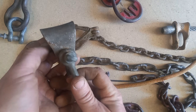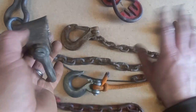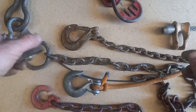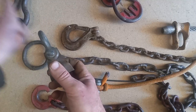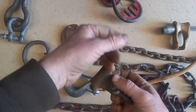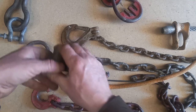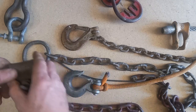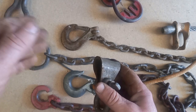Now mainline slides — this is a mainline slide I made. What a mainline slide allows you to do is bunch logs. Bunching is when you've got tree parts scattered everywhere in all directions and you run one cable through the whole mess, hooking a choker around each one. Your mainline fishes through, and at the end there's a termination. When you winch in, it pulls your furthest log, which slides and hits the next, bunching them up until you've got your whole cluster together — hopefully without jamming into stumps or flipping your machine.